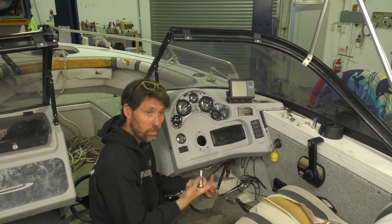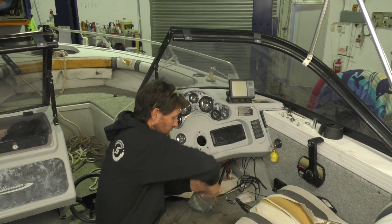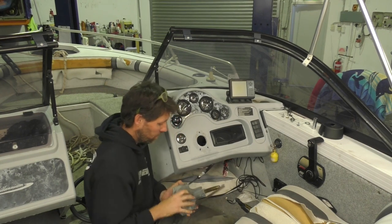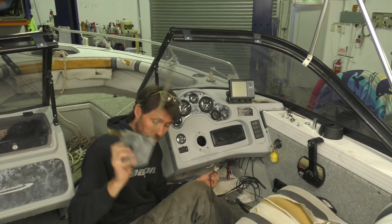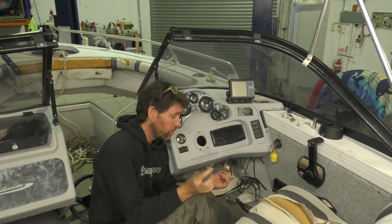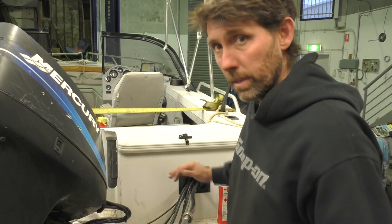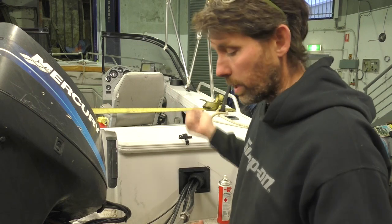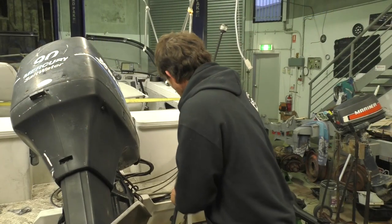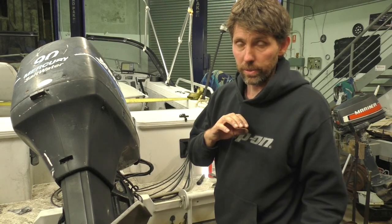This particular style of helm locks the cable in with a bolt and nut — some use just an R-clip. Cable is out from the helm now. Because this end is flexible and slimmer, this is the end I'm going to pull through. The goal is to pull this cable right through to the transom of the boat to remove it entirely. I'll start trying to pull it through from about mid-ships, try and get some slack, and then slowly work it out. And we're through — that's now all of the old steering removed.